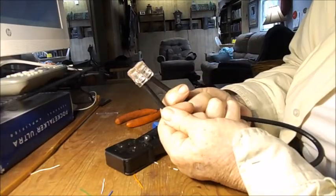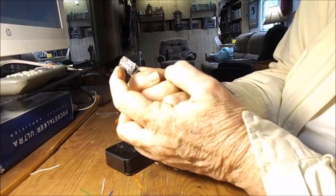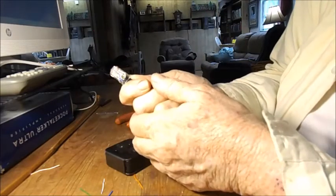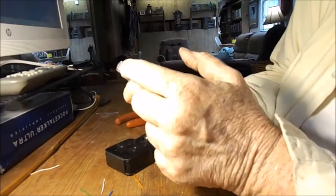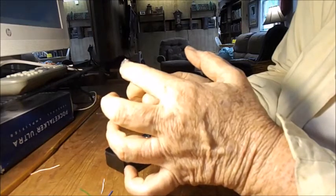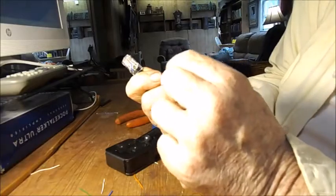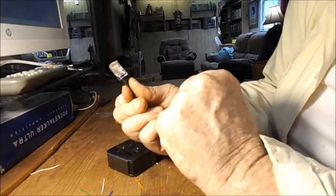The industry standard is actually the solid brown on the left side, then you keep the order — but I learned it this way. Everyone you use in your series has to be in the same order, meaning you have to have the orange-white on the left with the clip up. I connected something last week where I had the orange-white on the left to start the series and it was the only connector I put on wrong, so I had to redo the whole thing.